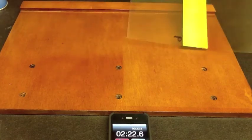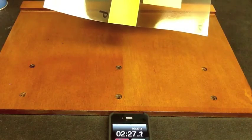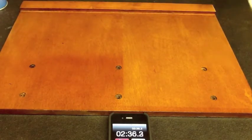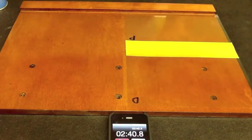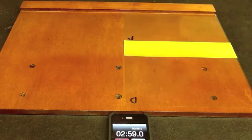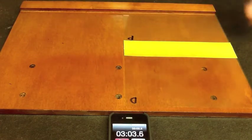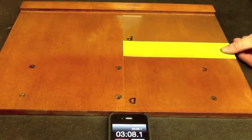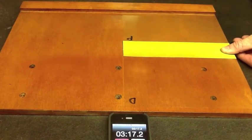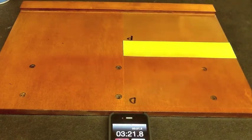What we might take a look at on our blending sheets, you can kind of see the difference between the pigmented versus the dye. The dye again is more translucent. The pigmented, we're going to add another coat to the bottom now that that's flashed a little bit. And again, it's real important not to wet the surface too much so that the pigments and the dyes don't tend to puddle or separate.